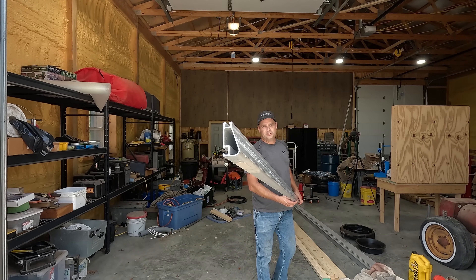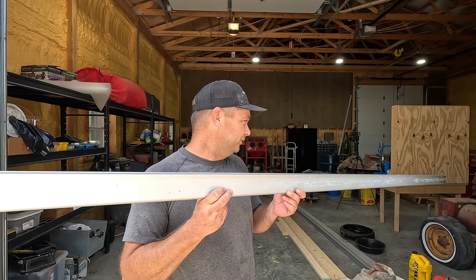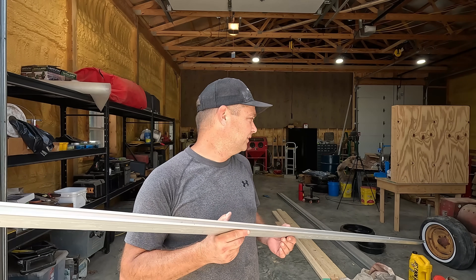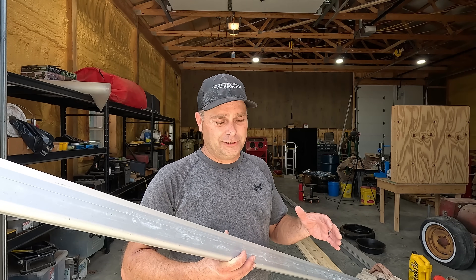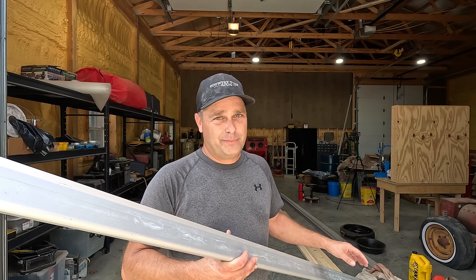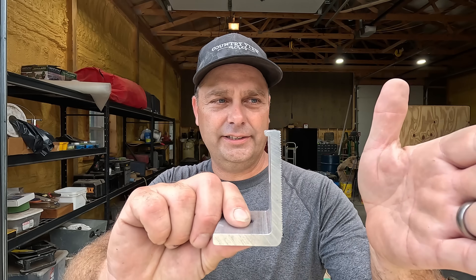This time I'm mounting the solar panels on the IronRidge mounting system — a 14-foot long aluminum rail that is very lightweight. My local electrical supply house, Kirby Risk, carries it throughout the Midwest. When I ordered it, it showed up at the store next day and I didn't have to pay freight, saving me a lot of money. To attach the railing to the roof you need an L-bracket: it mounts to the foot and then the railing mounts to the side.